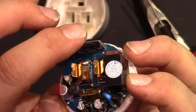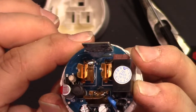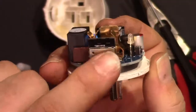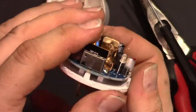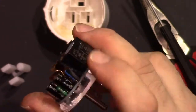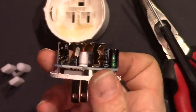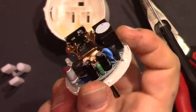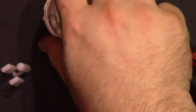The board is marked T201V1.0, and it even has the same markings on the back — there's ground, and trying to see if there's GPIO0. There's IO0, IO5, IO2. So this is going to be an ESP8266 — I'd be willing to put money on it. I'm not going to bother desoldering it, but take my word for it. And then again, we have the fuse to the relay and the fuse to the low-voltage power supply. This is a pretty standard design. I did a video on a light switch that has the almost identical power supply in it — I'd be curious if the values were even the same. It's pretty good; they haven't gotten cheap, which is nice to see.